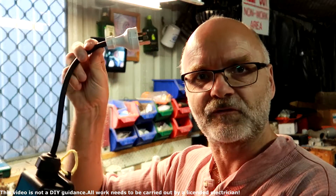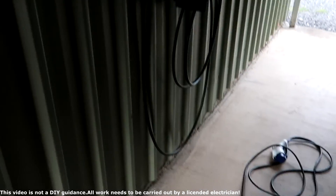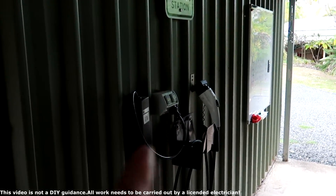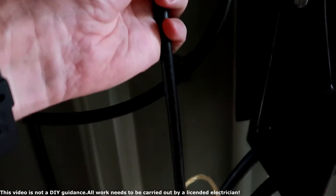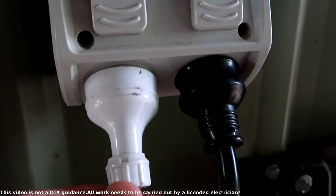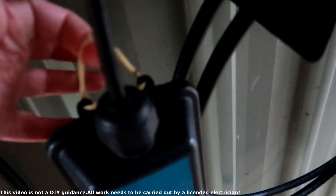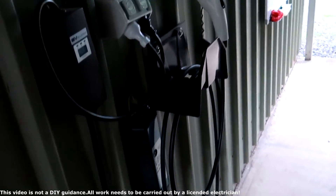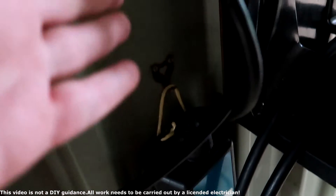As I mentioned before, I would like to extend this piece of cable a little bit. This is about 25 centimeters only and it's always a little bit hard to actually connect the EVSE to a power point mounted on the wall. If you plug in the EVSE it hangs on the cable, which is not ideal — it can easily come out and drop on the ground. You should have a little piece of string and a hook on the wall to hang the EVSE and take the tension off this cable.